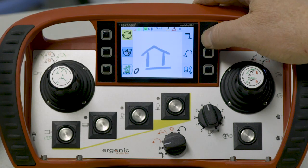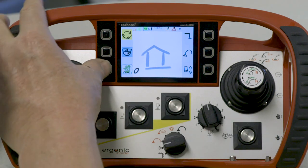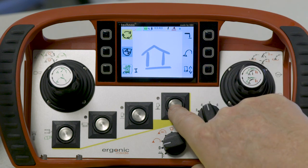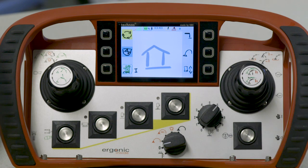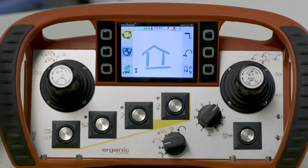EOC — Ergonic Output Control — is exactly as on the prior Ergonic units. When we select EOC, as we move the joystick, the engine RPM is automatically increased to a pre-selected RPM for the load. When we turn the pump on, depending on the position of our volume control dial, the engine RPM will go to a preset speed. When we turn the pump off or let go of the joystick, after a brief period of time the engine will go back to idle. This takes away the operator having to remember to throttle up and down as he does different pump functions.